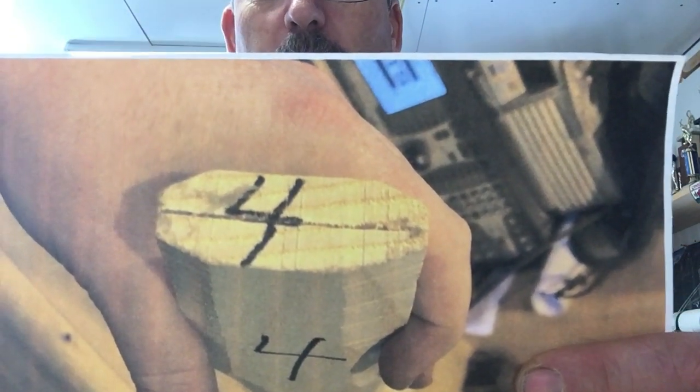However, if you put that grain and run it with the handle, it's every bit as strong as handles with fewer growth rings running across the eye. This whole lumberjack has had to change his ways. I've sent out instructions to customers who ordered axe handles from me. Way back in the day, I had a handle with a lot of what I call white wood — that's handle number four. See that handle? There are only about five growth rings in the whole handle. So the ratio of late wood to early wood is really high, and you'd think that handle would really be the strongest. And it was — in all my tests it took the highest force, the longest time to break, and moved the farthest distance before it broke.